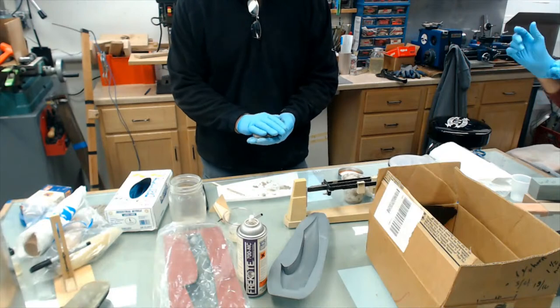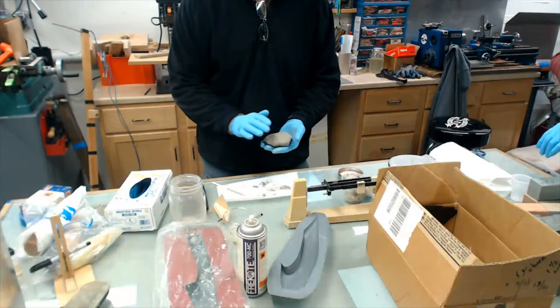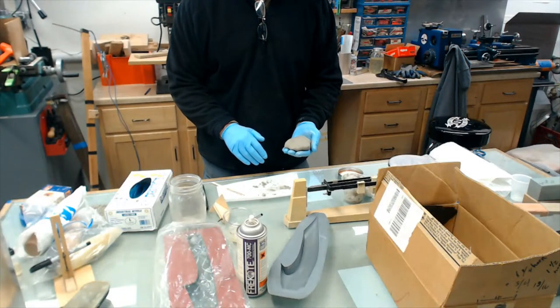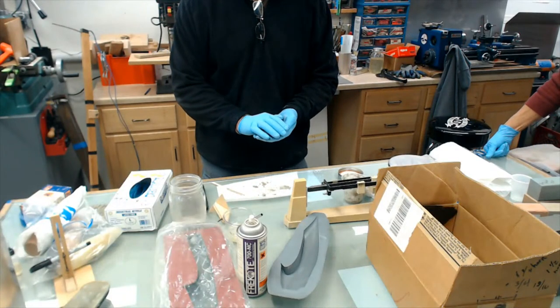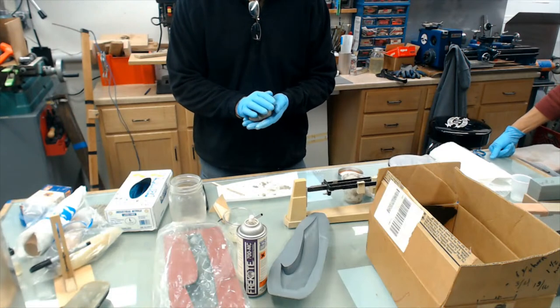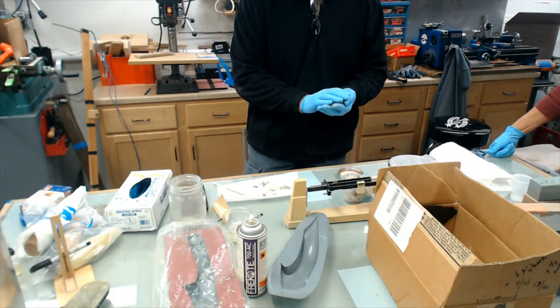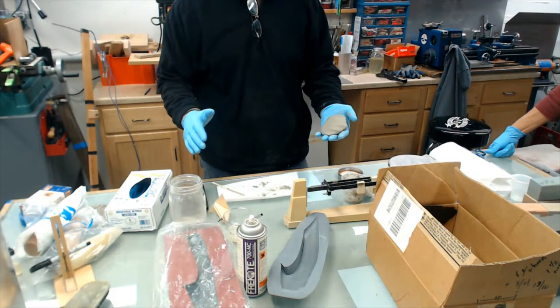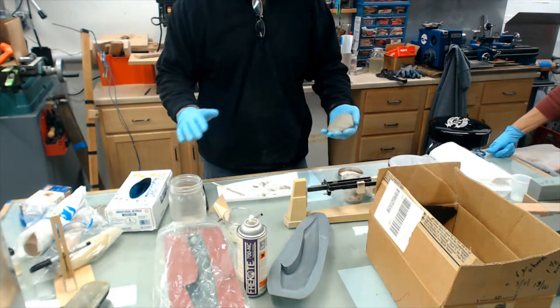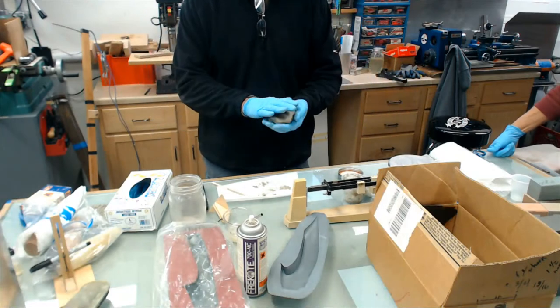So once this B stages, you can rub it and smooth it and fill it or make your mold. And then you could grab your wife's dough roller and roll it out in a sheet and then put it on top of the mold. That's what they do, they actually roll it. Sometimes it's more beneficial, depending if you have a big flat. You take two pieces of 1/4 inch music wire and roll it out that thick, and then you've got it.